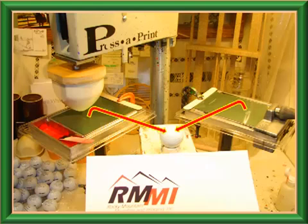and I do kind of a print and adjust process. Actually, it takes me 5, 6, 8 tries before I nail it on the two-color registration. I just sacrifice an old golf ball to get it just right. Some of the newer pad printing machines have a 3-axis registration table with micro adjustments, and that makes this even simpler to do. Now, tighten the set screws, and the machine will find its position with each print.